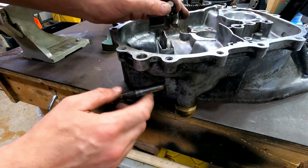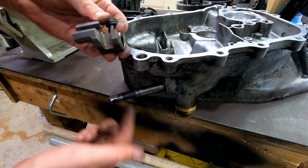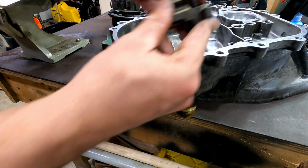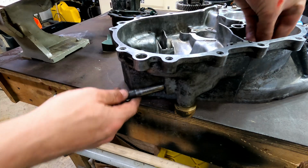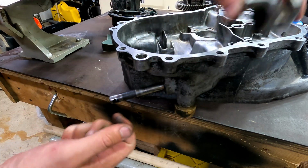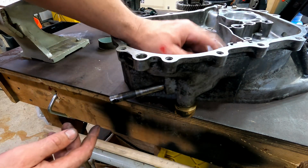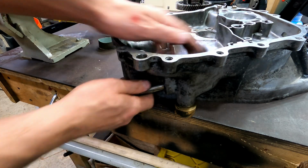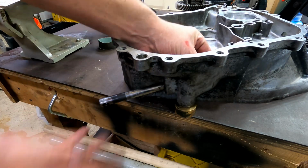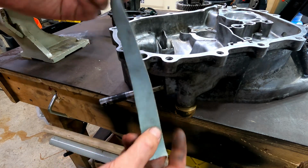So we're going back to installing that new seal here and cleaning up that corrosion. What you have to do to move this shaft out this far so you can clean that up is to take this, which is down in here, you take the bolts out, slide that back, pull that piece out, set it aside. Don't go far enough that the spring and the ball fly out. But you can go on out to about here, and you just get some nice emery cloth.